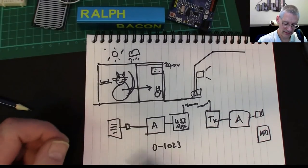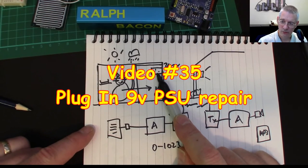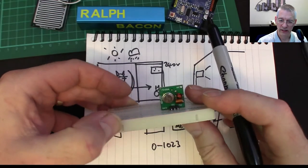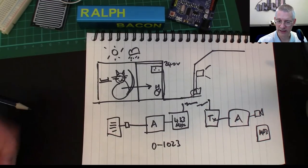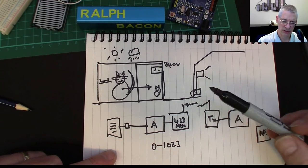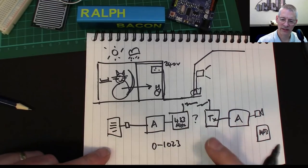Getting rid of all that complexity was the right call - though it would have been a nice little project to prove it could work, and I might still do it in the future. It just feels like over-engineering, and the solar cell is surprisingly expensive. At the moment, to supply 9 volts to the Arduino I've got 240V out there, so it's just a wall wart - in fact I may use that repaired one I showed in a previous video. The 5V output from the Arduino can then simply supply the 5 volts to the 433 MHz transmitter.